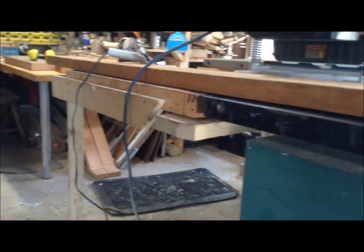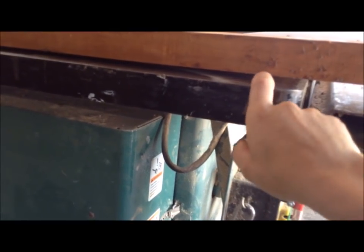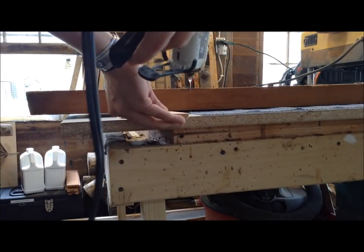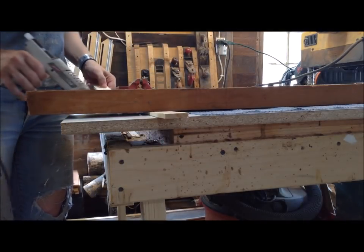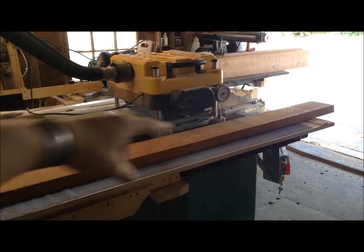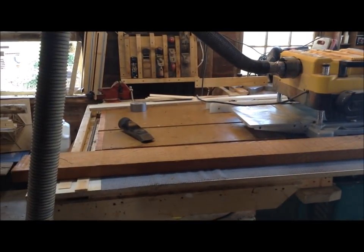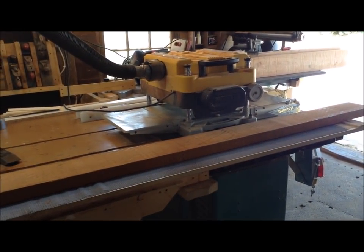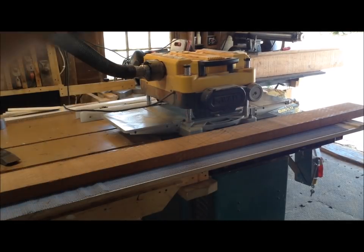If you bend down here you can see these two surfaces are not perfectly even — you can see the gap in this piece — and this is where I'm putting the shims. I have everything set up with hot glue on two sides. This one bows high on both ends, so I made sure to measure the height off the end going in first so I don't jam up my planer. I'm going to keep sending it through until the entire top surface has been planed. Since this is rough sawn lumber, as soon as that roughness is gone, it should be good to go.